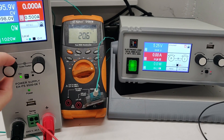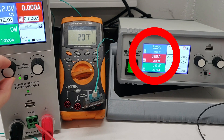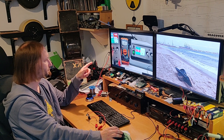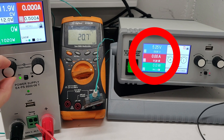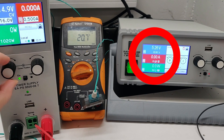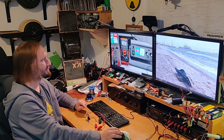Now let's get some more input voltage — 99V, 100V, 110V, 112V, 114V, 115V, 117V. Let's stop right there. You can see at about 116V, let's say above 115V, the output voltage started rising above 5V. That's not a good sign. Let's see what happens.